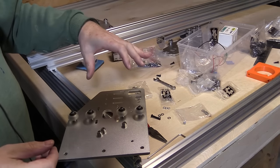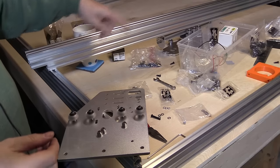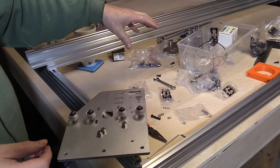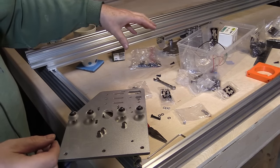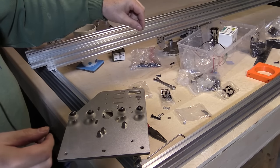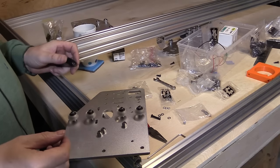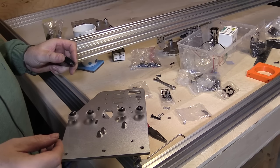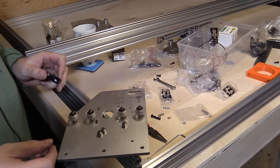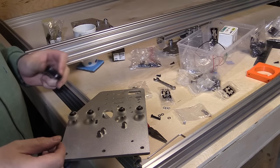Any play apparent in the wheels is going to translate to errors in your cutting surface. If you've got a little bit of play as your wheels are moving — whether it's up and down, left, right — as your gantry is moving and your cutting head is putting pressure against the work, it's going to allow a little bit of slop and you might get little ridges appearing in the work when you're trying to cut it. So you need to make things as tight as necessary to eliminate that, but not so tight that your stepper motors have to work overtime to move everything around.